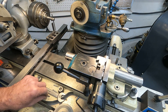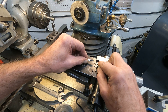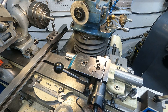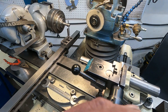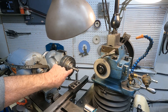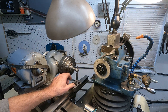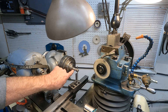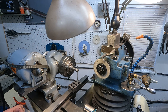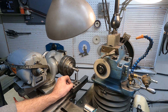The first step is grinding a flat right here — I got a flat ground in that. Getting this machine set up: here's the little mandrel that I drilled in the old Brown and Sharpe milling machine. That was fun to do. I got a big old parallel sitting here, a one-two-three block, and a cute little square.